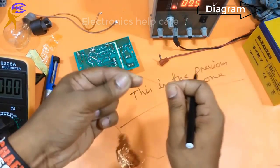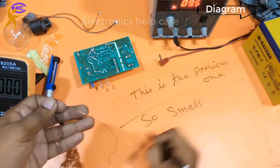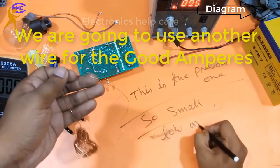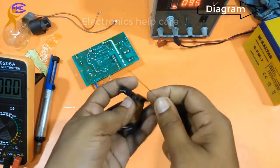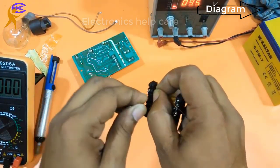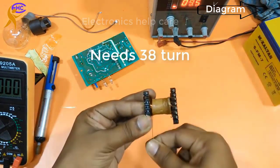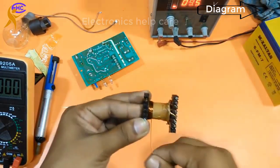The previous wire was used for 220V and its gauge is too small. I need a bigger wire — 20 AWG wire gauge. I am using 20 AWG for the secondary winding. We need 38-0-38 turns to get 35-0-35V output.